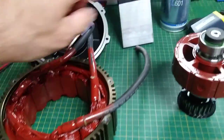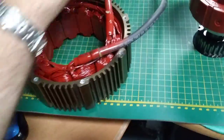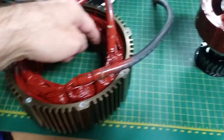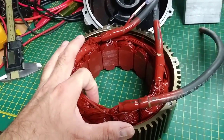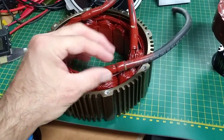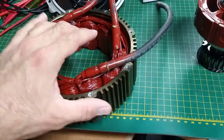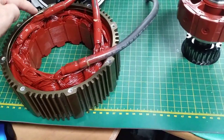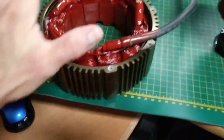The reason for varnish addition is very important. Water will get into your motor — it's not a question, it's just a matter of when it happens. Even water can be sucked through the strands of your wires, go into the wires, exit, and go onto the core of the stator. This has been proven and tested — industrial motor companies know that. When the motor heats, the pressure variation between the inside and outside will create a suction effect. When the pressure inside is lower, water will find its way through every single crack and every single possibility.